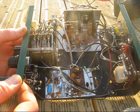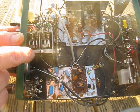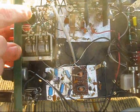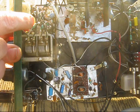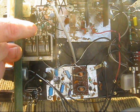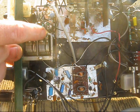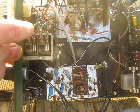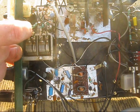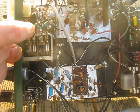The transceiver is still under development. The main tuning control is a two-gang variable capacitor — one gang is used for each band. There are two variable frequency crystal oscillators: one on 7MHz and the other on 14MHz. The 14MHz one uses a 14.060MHz crystal, and the 7MHz one uses a 7.030MHz crystal. Two crystals are used in parallel in each stage to increase the frequency swing.